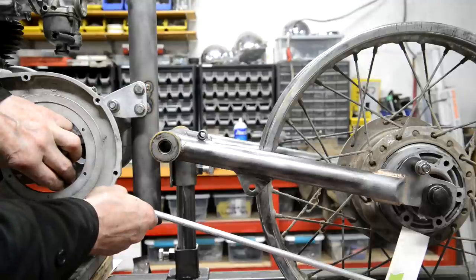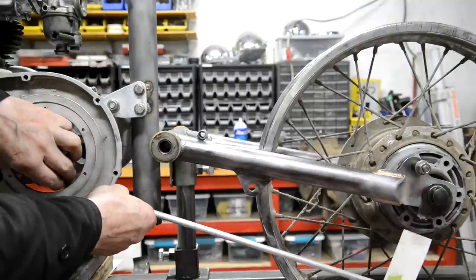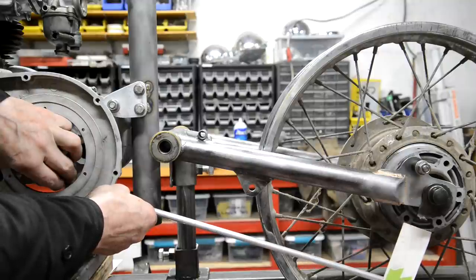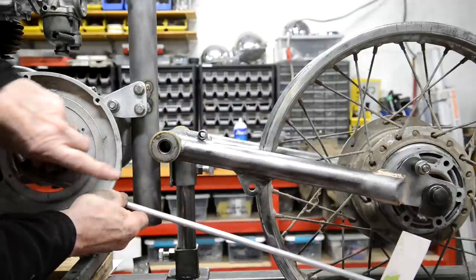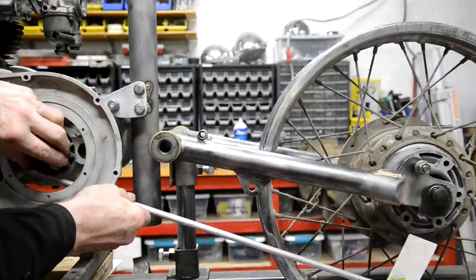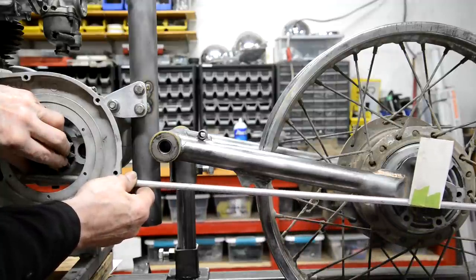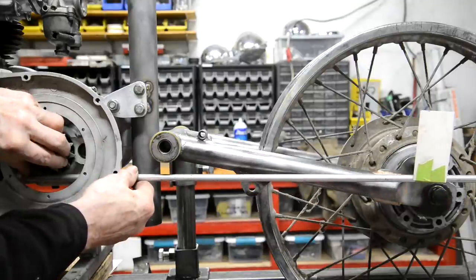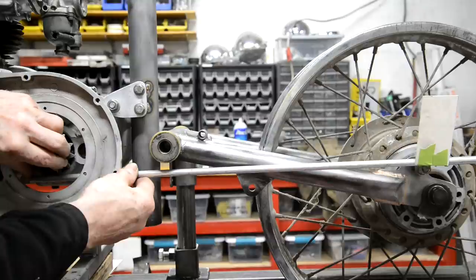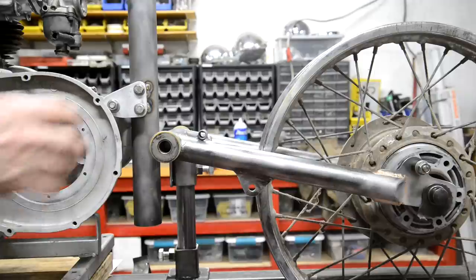Now, the 14-inch shocks I'm getting, rear suspension units, I keep using that horrible American term, although they call them rock shocks, but anyway, never mind. I'm rambling again. They have just under 4 inches of travel. So as I say, that white piece of card is 3.5. So what we've got to do is watch this chain line, right? There it is. So now it's going to start coming up as the wheel would. That's 3.5 inches of travel. And we're still going up. Okay, and we're not touching that. So that is where it should be. That I think was fine.